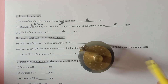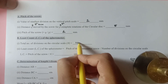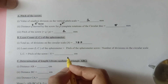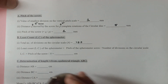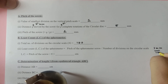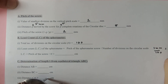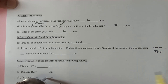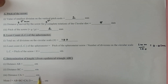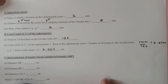The total number of divisions in the circular scale goes from 0 to 100, so we have 100 divisions. The least count is pitch divided by number of divisions, so that is 1mm divided by 100, which gives 0.01mm, or in centimeters, 0.001 centimeters.